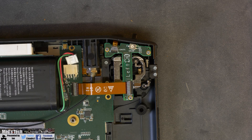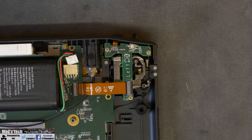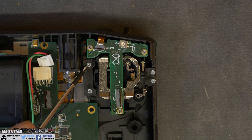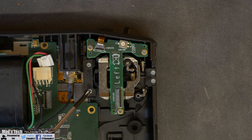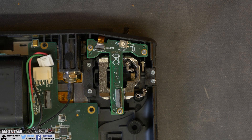Taking a close look at the gimbal we are going to modify: the first thing you need to do is remove the ribbon cable that goes to the board for the controller. You need to do this very carefully because it is delicate — simply flick up the little black lever on either side of the connector and then gently remove the cable. Once the cable is removed, the next thing is to remove the block that holds the gimbal in place on the right hand side. These two screws hold it down, and once removed this allows you to get the spring tensioner out and then replace this block with the new one. You can do this without removing the top PCB, however you can do so if you find it easier.